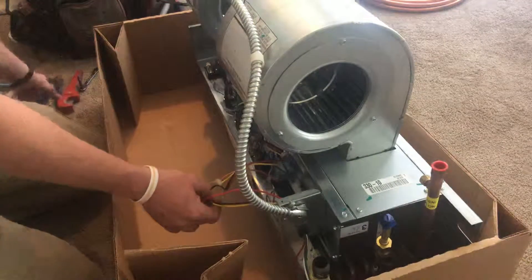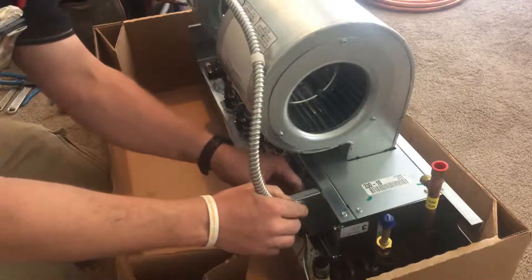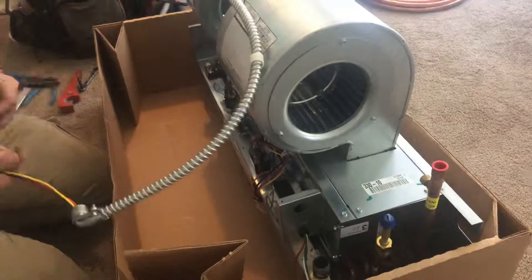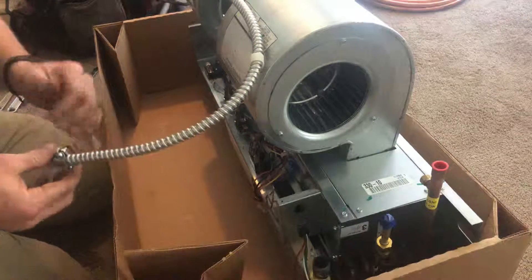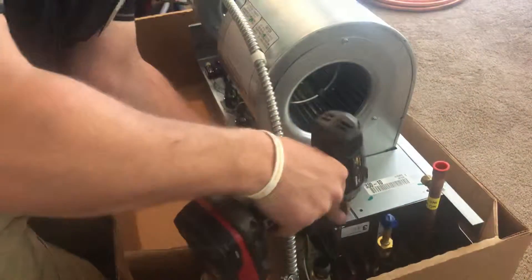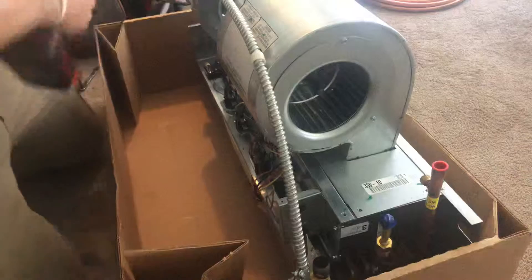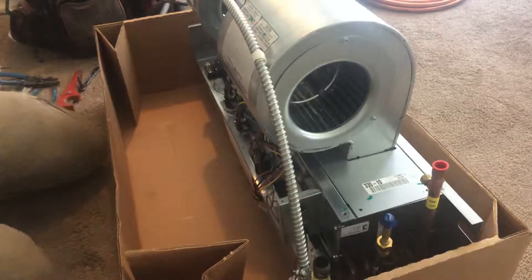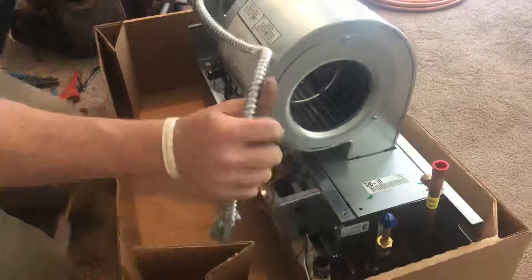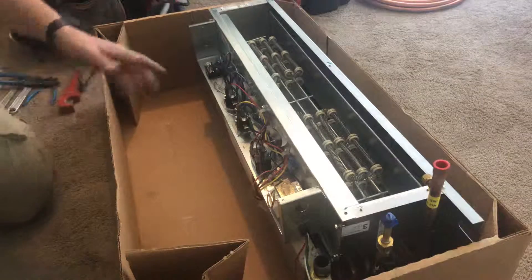To make the unit lighter, I'll cut everything — I know how to put the wires back. It's real simple: red goes to red, black goes to black, yellow and orange go to yellow. Real simple screws on these new ones. I've installed Goodman in the past, but I'm more satisfied with these — the electronics are cut and dry.